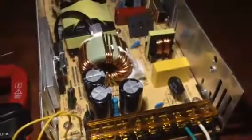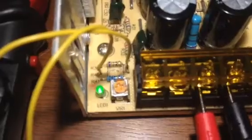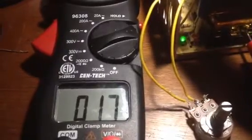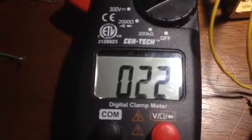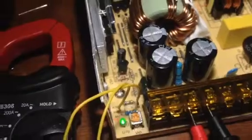So, if you wish to achieve above 14 volts on the 30 amp switch mode power supply, add a 1K ohm resistor across R40 and then you should have control from around 11 volts with no problem. A 1K ohm resistor across R40 will give you high voltage on a 30 amp switch mode power supply.